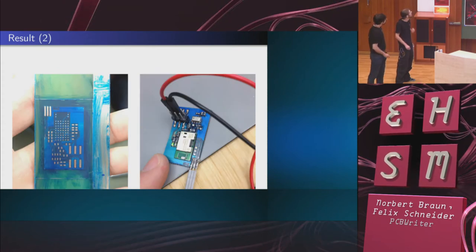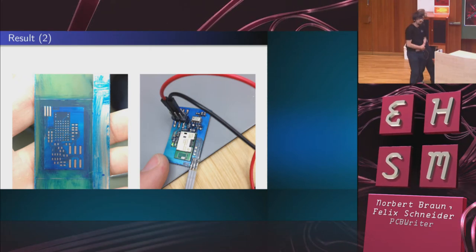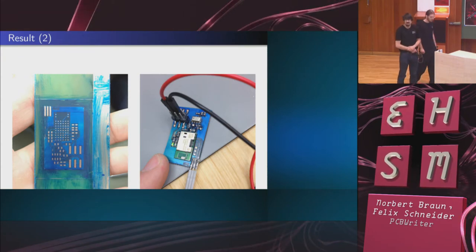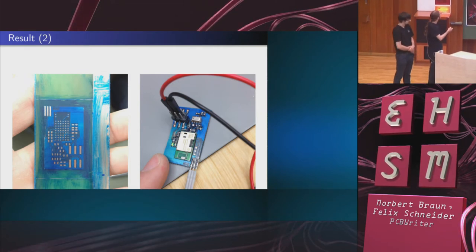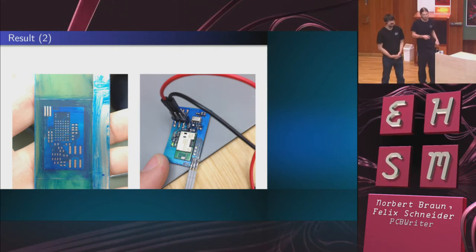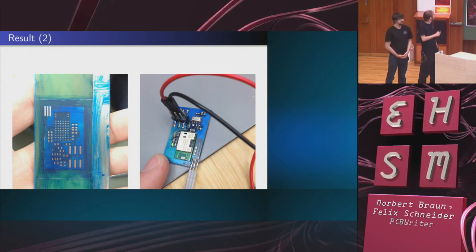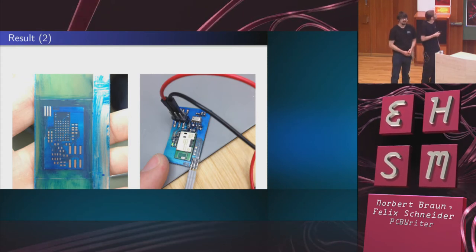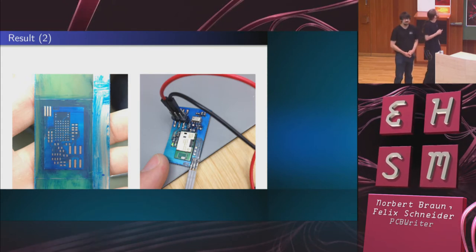This is actually a 1.2 millimeter pitch BGA package for a Bluetooth 4 low energy receiver. And it's broken out in one single layer. You can see that here two traces go along between the two balls, or landing pads for the balls. And this is an LGA8 package, so no balls, and fully populated, works as expected, and quite good quality.